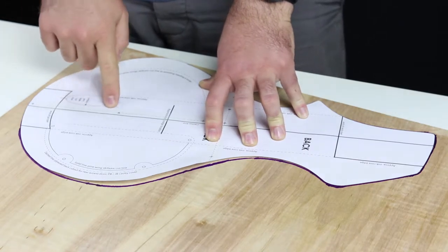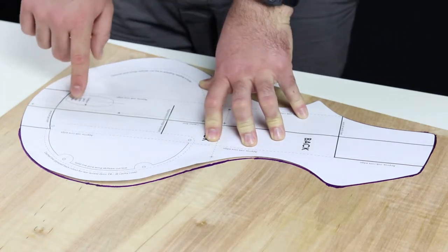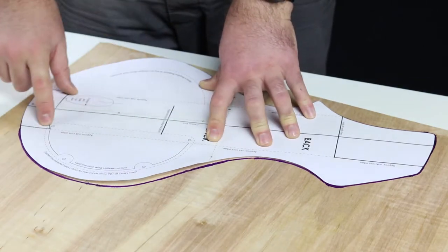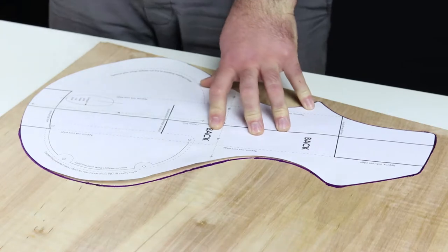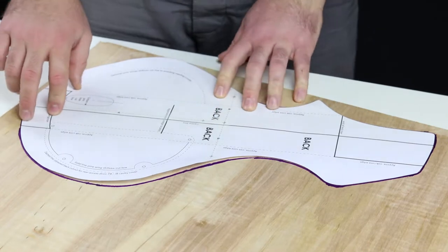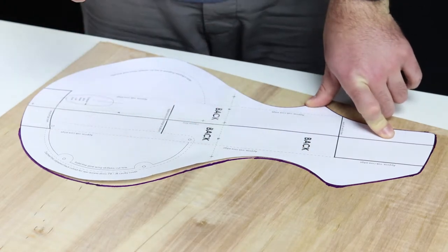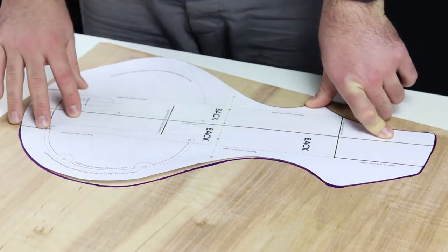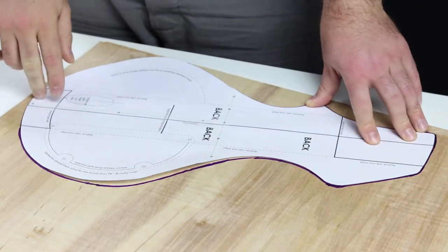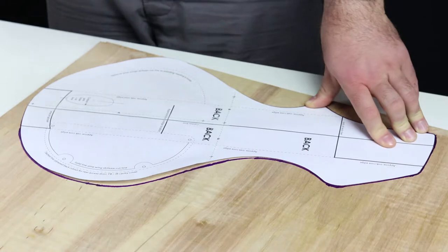And then the other thing we gotta cut out here is the output jack hole, which once it's glued together, we also have to cut through the oak core, but it's right in front of the tail riser piece, because the oak core, aside from the neck riser and the tail riser, is only a half inch thick and it runs along the inside back of the instrument. The tail riser and neck riser sections are the only ones where the oak is double layered and the full inch in height.